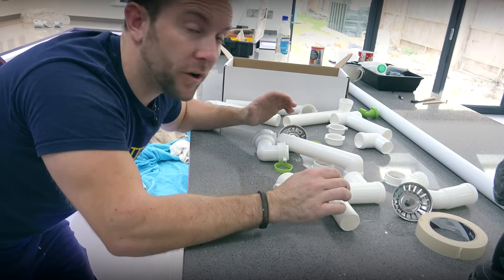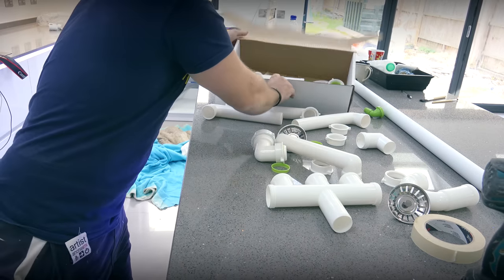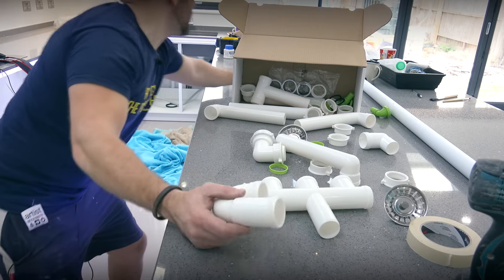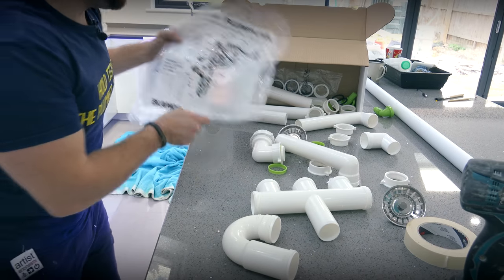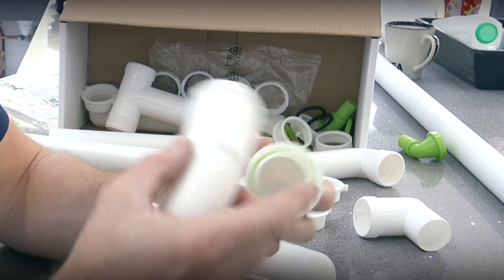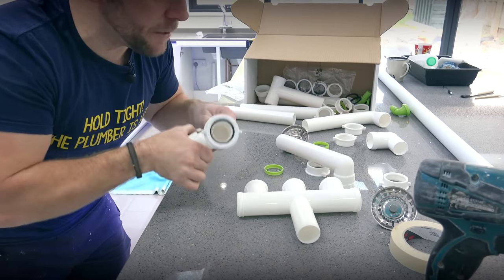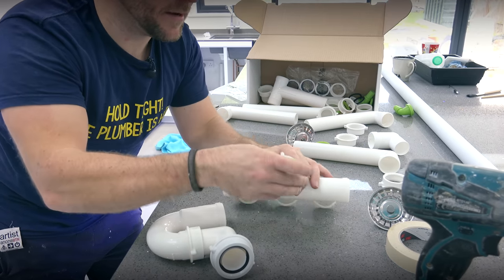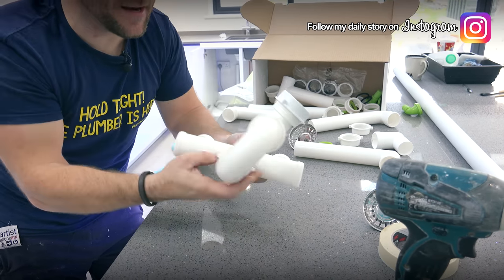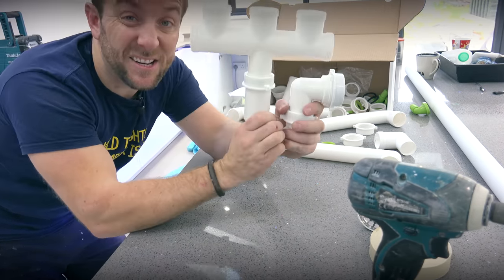What I do now is have a quick look at what you've got. There are some bits we're not going to be using, and quite a lot of bits we're just going to be setting aside for a second. First thing we want to do is have a precursory glance at our instructions, and really what you want to do first up is just get your trap made. This will convert us up to standard inch-and-a-half UK. So we're going to pop our trap on like so, and then we're going to be using a compression fitting underneath with a small little plastic bit on there to go onto that. And suddenly we've got our manifold made - and it's completely adjustable as well.